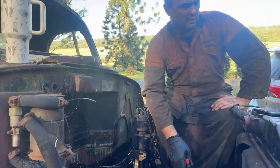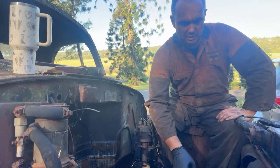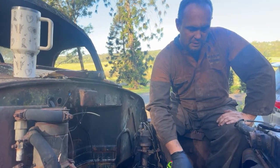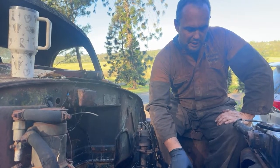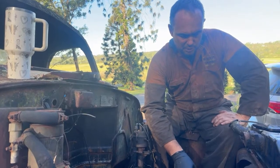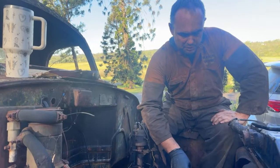Best thing they recommend for fuel pumps, and I've had them done up, especially in cars, you put a cap full of engine oil in the diesel tank every time you fill up. It just helps lubricate it, because they reckon the fuel these days isn't as good as it used to be, plus all the finer tolerances in pumps and all this late model stuff.